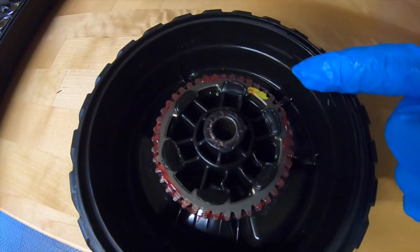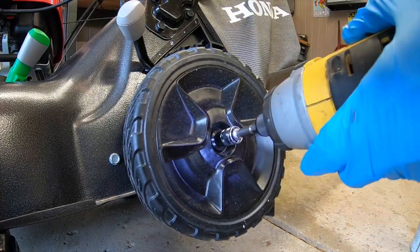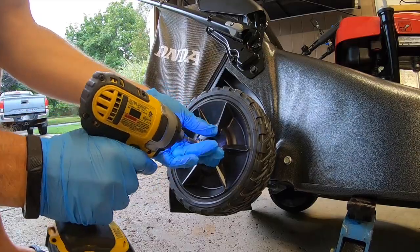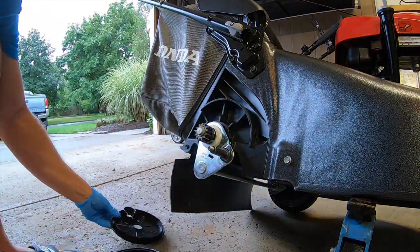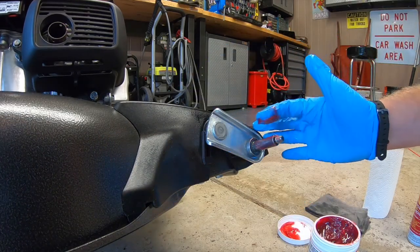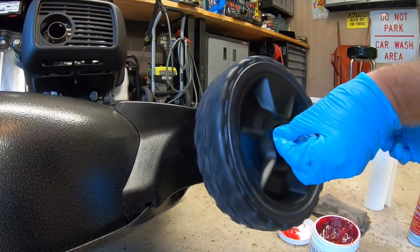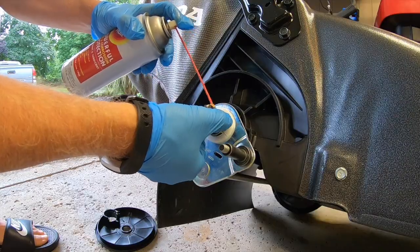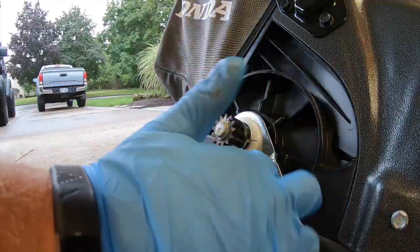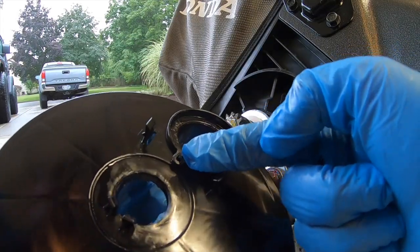We're also going to put a thin amount of grease around the outside of this gear — just work it around by hand, just like that. That's what it should look like. Slide the wheel back on, put the bolt back on, and send her home. So now this side is all lubricated and protected. Now we're going to go on to the other side. Also, here's a little pointer: this little metal tab right here, make sure that lines up into this slot right here.